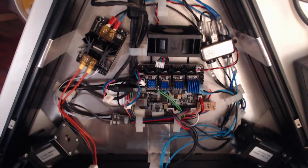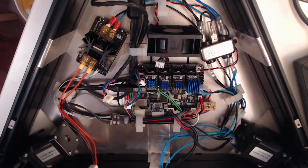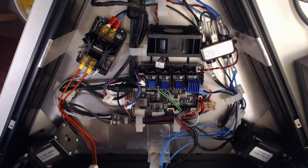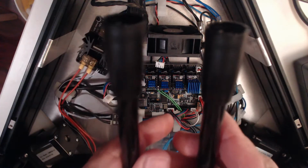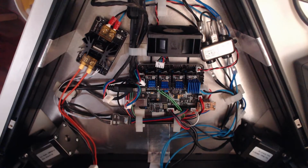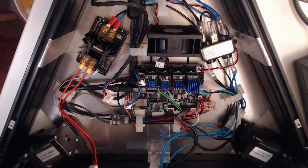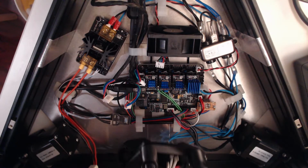So if I move the rod, these are the ends of those actuators. They connect to some magnetic ball joints on a belt connected to the motor. So these belts that you see here and here, there's another one there, which is the one I'm moving, connect to belts, and then they move a pair of joints that are magnetically connected to these, and that's how the printer moves. I move that up and down. See that those diodes are doing their job, because before there'd be a green light coming on here, meaning that it's spreading power through and it's on. Thanks, welcome. I don't know if you can hear that moving up and down, but no matter how fast I do it, no power's getting through. That's a good sign. Now plug this back in, and we're going to do some adjustment.